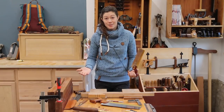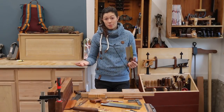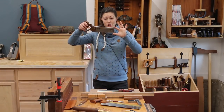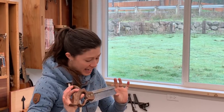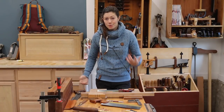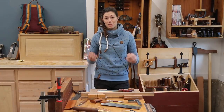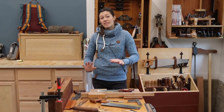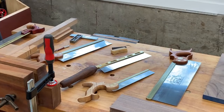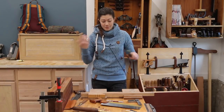Much like with other hand tools, the magic disappears the moment your tool is dull. Traditional craftsmen would sharpen their saws every day after work, so you see these older saws that have been sharpened down to a little nubbin — that's because they were constantly being sharpened. I myself have been guilty on multiple occasions of letting a saw go for weeks, months, even a year in some cases between sharpenings. Saw sharpening itself can be extremely intimidating, but there are tons of resources available online. The nice thing is that most dovetail saws or joinery saws are filed with a rip filing.